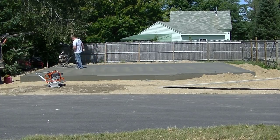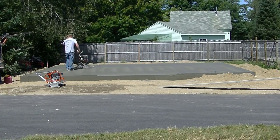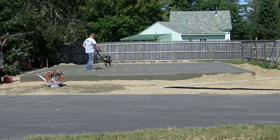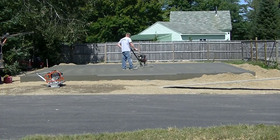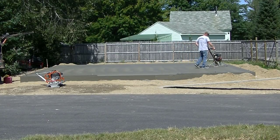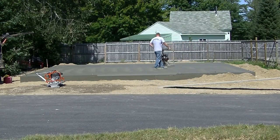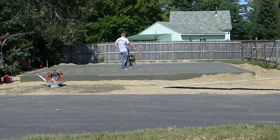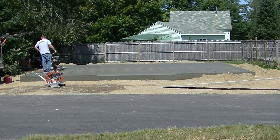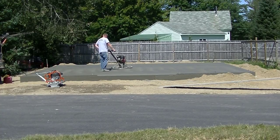This is the fourth hit now — the fourth time he's hitting it with a power trowel. He hit it with float blades the first pass and this is the third time with the finish blade. Luke's got the boards all stripped off — you can see how fast, how hard that concrete gets. He's going east-west again, even though the slab is really hard, still crossing his pattern on this hit. Between the third hit and this one, Darren waited about 20 to 25 minutes and let the sun dry the surface up a little more. If there are any little tiny rough spots or rock holes, he's filling them in this last time. If the power trowel doesn't fill those spots, the guys will use their hand trowel — either stop the trowel to fill the spot, or balance the power trowel with one hand and reach down to fill the hole with the hand trowel in the other hand.